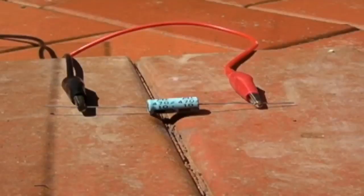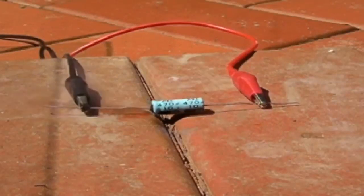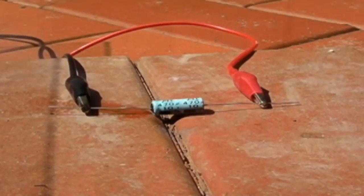Here's the first one. This is an axial electrolytic capacitor and it's a 10-volt type. I hooked it up backwards to a 15-volt supply — didn't overload it by much. This wasn't catastrophic by any means, but it did actually leak all its electrolyte. The pressure built up inside and it went poof, and all the electrolyte just spewed out one end. That wasn't very impressive, but it's pretty cool.